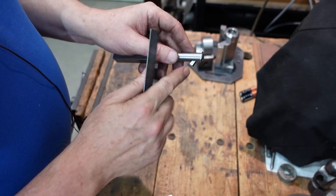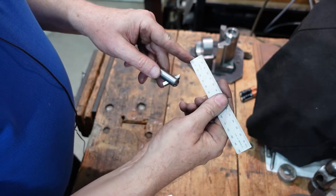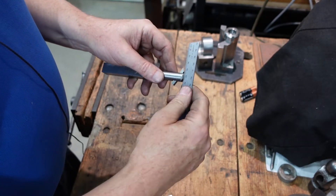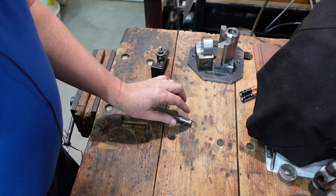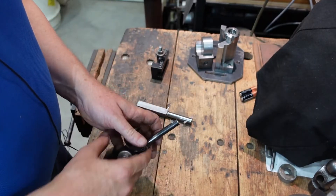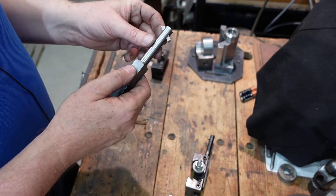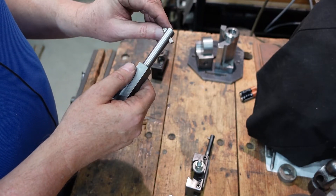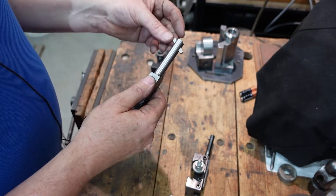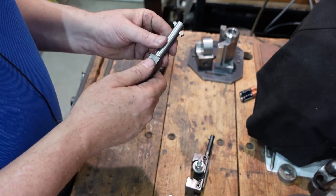The skewed bar, as well as making the tool easier to sharpen, puts the tip about five millimeters from the end. If I contrast that with a straight one, it's more like 10. So I can get a lot closer to the end of a bore without any dramas. If you didn't want to use something like this for threading and wanted to use it for boring, there's nothing stopping you — you could just grind a slightly rounder tip or a different shape and you'll be right.